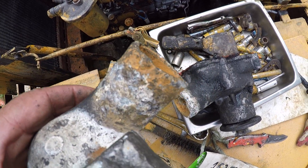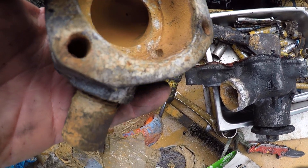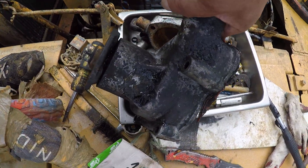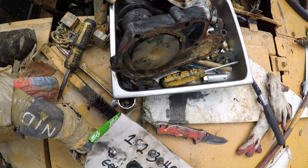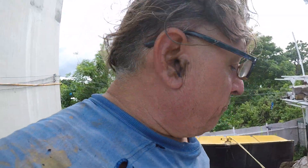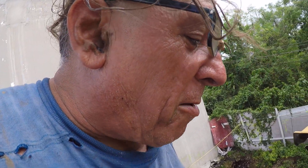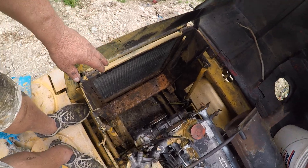When I put the new hose on, this hose has to be replaced, and the hose from here has to be replaced as well. The grease was coming out of there and then went into the alternator. The alternator didn't catch fire, but the grease made it so hot it melted the armature and somehow shorted out the stator.